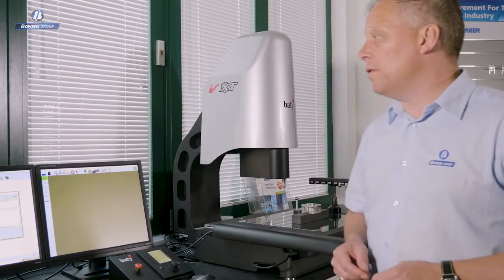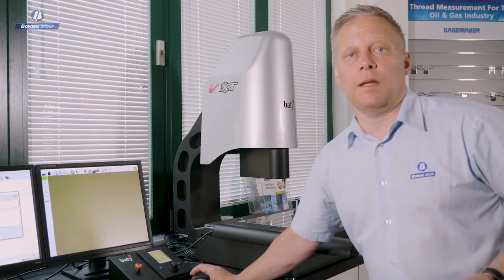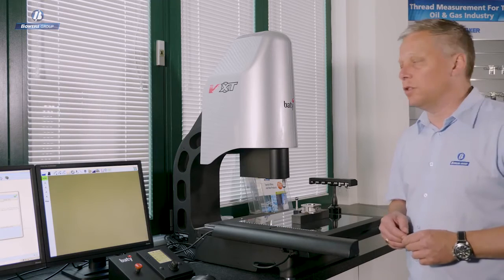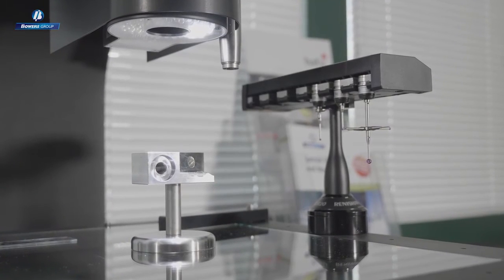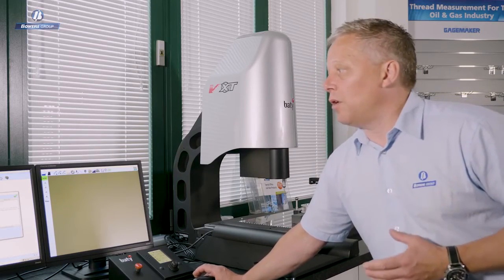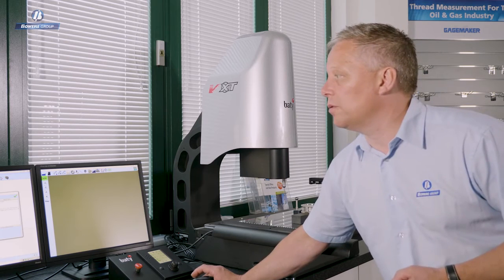Okay, so we've used the video edge detection tools, the camera-based measurement tools for measuring features and scanning profiles, comparing to DXFs. Let's talk now a little bit about the CMM side of the machine. Standard Renishaw TP20 module is mounted there. I'm in the middle of building some probes for that. Baty Fusion V4 software manages probes incredibly well. It makes it very easy for the user to build probe sets and new modules.